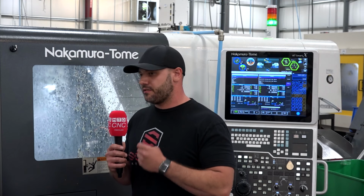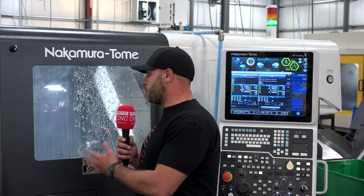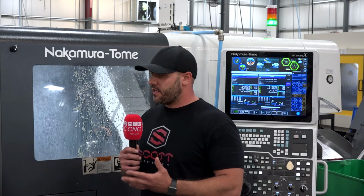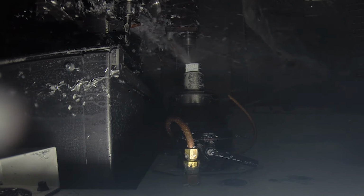The efficiency, the way we're machining it, and the good news of a lot of the parts that we use is 6061 aluminum, which is very forgiving. It cuts very easily, and I max out all the speeds on everything I do for the live tooling. That's a max of 6,000 RPMs on all the live tooling on the turrets. I max them all out. Wow. I'm able to do that and still make sure I keep the tools for all those 10,000 pieces basically too, which is amazing. Yes, it is.